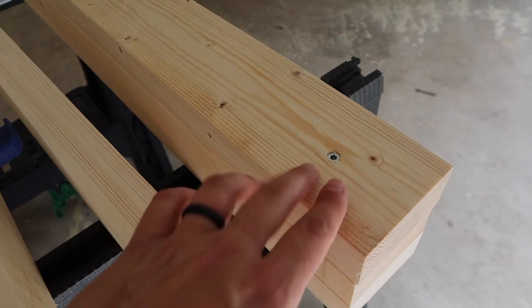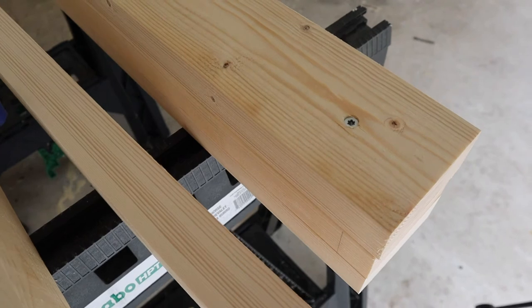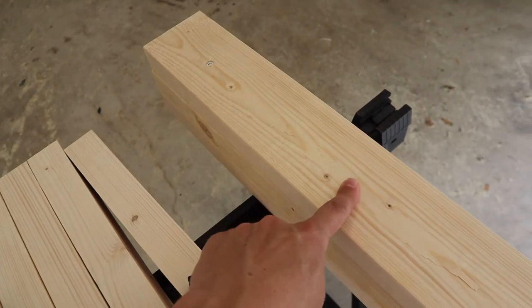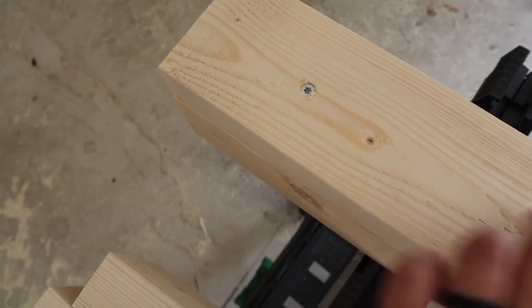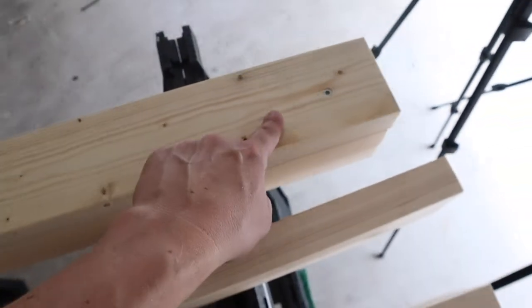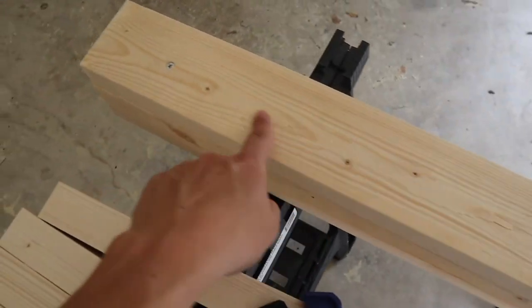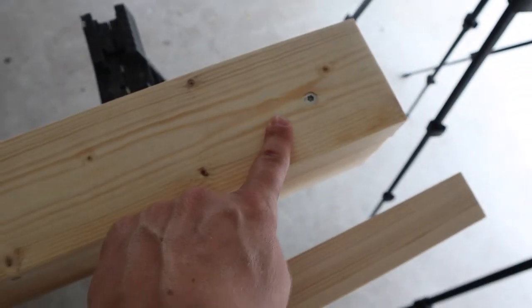This is where you have to remember where you're drilling your screws. For the second board I drilled in the middle — one here and one around here. So with the third one I made sure to offset: one here, one dead center, one there. Once I fill this with glue and put the next one on, I'll know not to go in the middle and not to go on the far end. Just remember that as the layers add up.